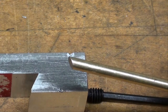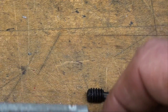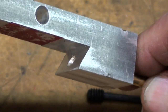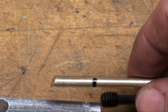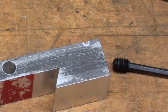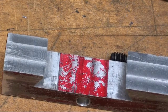As you can see, here's the brass rod with the 60-degree cut on it. It's going to fit into the hole in a manner like that, so that the set screw can push against it and lock this onto the dovetail on the South Bend lathe. I'm going to cut this off on the black mark, and then this quarter-twenty set screw will go in there and push against that. I've drilled the hole right here and as I told you, it sure did weaken it — it's pretty thin there, and I can see it wanting to bend a little bit. But for our purposes and what this is going to do, that's not going to be a problem.